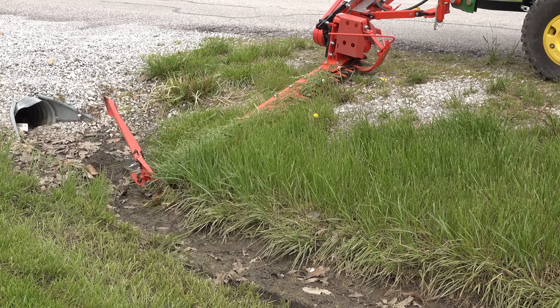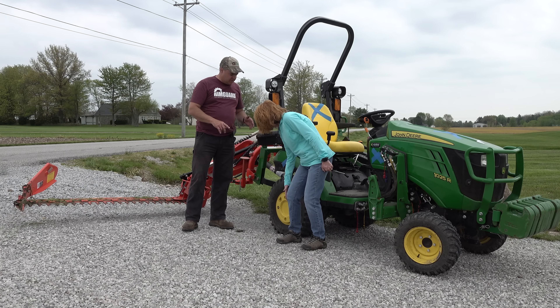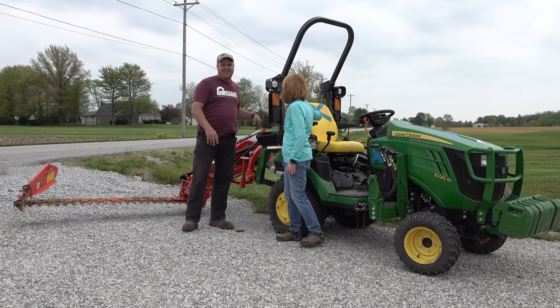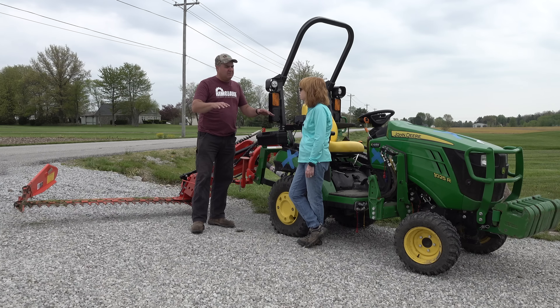There are not many offset approaches that truly work well on a subcompact tractor, and this is one. I like that you can stay up flat and run it down in there — there's no tipsy feeling because you're flat. Now if you do have to run on a little bit of an angle, I would recommend getting the loader on because that'll give you a little more weight. We have rim guard in the tires and wheel weights on the tires — definitely the left one helps a lot, although I didn't feel tipsy at all when level. It's more tipsy if you get on a little bit of a bank.